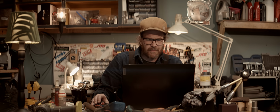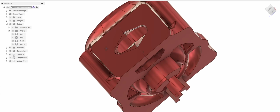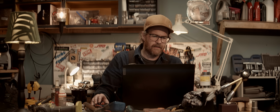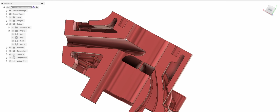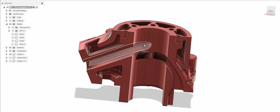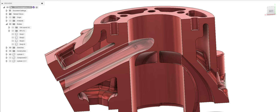So here's my cylinder split down the middle. Well, actually, this is more like what it looks like now. Somehow I made the exit area of the exhaust duct too small. I knew what area I wanted, and I got some numbers mixed up, but that's fixed now, so that shouldn't be our problem. And also, you might notice there's no bridge here, because this started out as a 100% bridgeless exhaust with a special piston and ring and all that stuff, but there's a bridge in there now in the current cylinder.